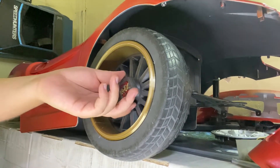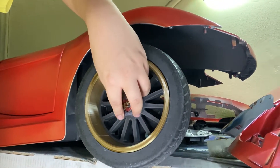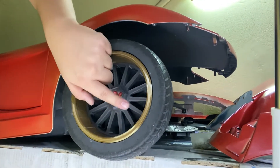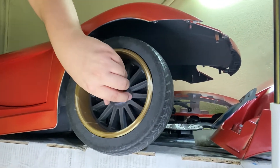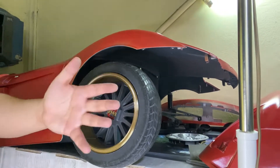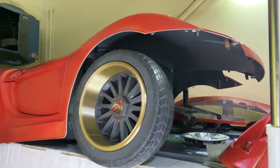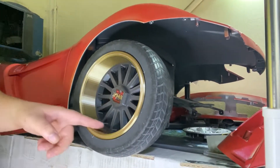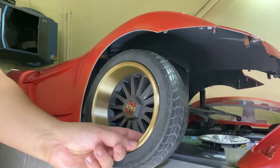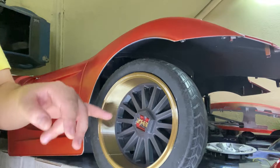I don't have the nut yet but I'll add it afterwards — it screws without a problem. I did use supports for where the rim sits on the wheel. We're going to call this part the face and the other part the limb. Because I made such a huge offset, I had to cut and shorten the axles so the wheel wouldn't be poking outside — it will sit basically flush with the body. The thickness of the base affects how much offset you get.